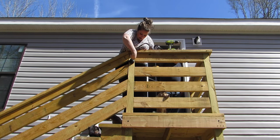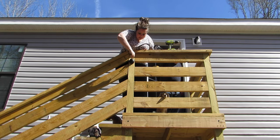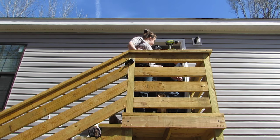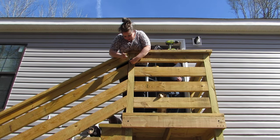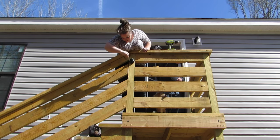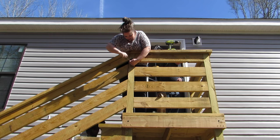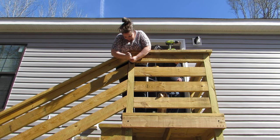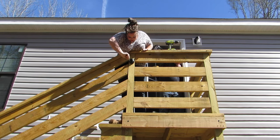Since I'm going directly into wood on this one, I didn't need the anchors. I ended up mounting three of them into the eaves on my house, which are wood and some cement board — so no anchors needed there. I mounted the fifth one on the power pole behind my house, which is also wood. But if you're mounting into drywall or anything without substance behind it, drill a slightly bigger spot, put the anchor in, then drill into the anchor. That'll hold everything steadier, tighter, and make sure it doesn't fall off or rip part of your wall out.